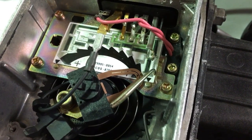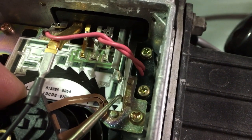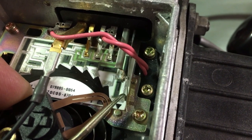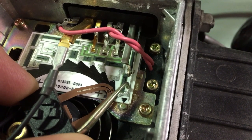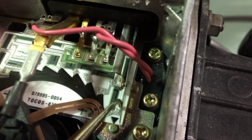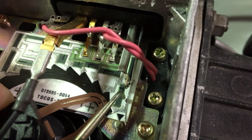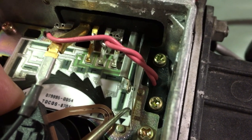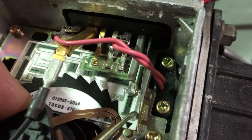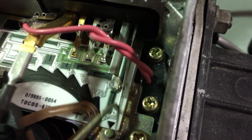There's actually a little mechanical switch. When the door flaps open, the first thing that happens — see that little relay right there? — it closes as soon as you get any airflow going to the motor. That little relay is what is responsible for grounding out FC, which is your fuel control. So you better make sure those contacts are clean in there.